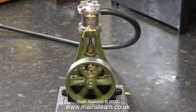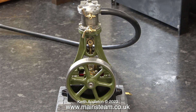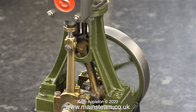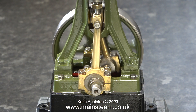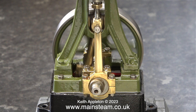The engine has a very strange sound at bottom dead centre, and that is because the port face is slightly pitted at the bottom part. I didn't deem it necessary to remove so much metal to get a perfect finish. I'm using a can of WD-40 to lower the viscosity of the oil used to lubricate the parts — but be careful, because WD-40 is not a particularly good lubricant, not for small steam engines anyway. I use compounded bearing oil from a company called Hallot Oils, and I usually add a small amount of rapeseed oil or canola oil into the mix. This acts as an anti-friction additive and it is quite effective.